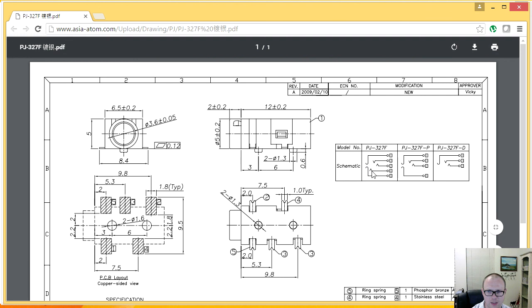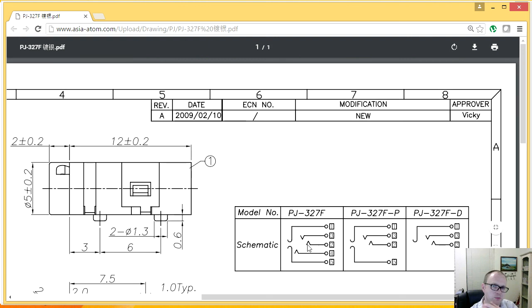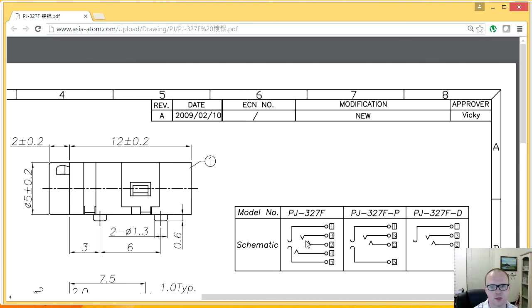So what I'm going to do is connect these two. These are the frontmost pins. I'm going to connect those through a summing resistor, so it acts a bit like a mixer. Very, very small value, maybe like 100 ohms or something, so that regardless of whether I get a test signal on left or right, it'll work.